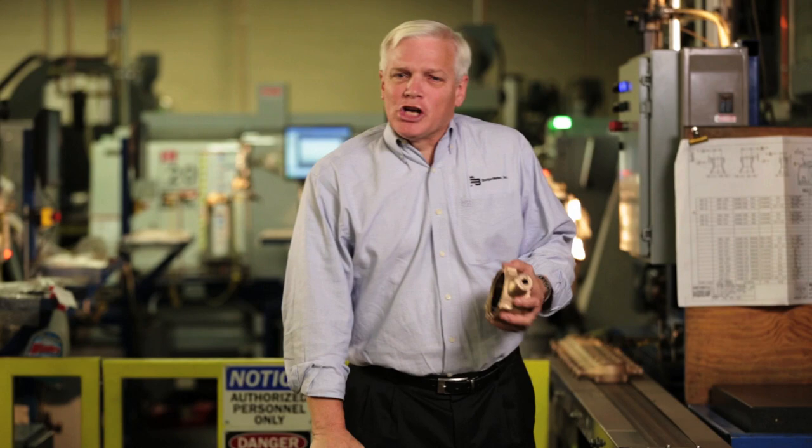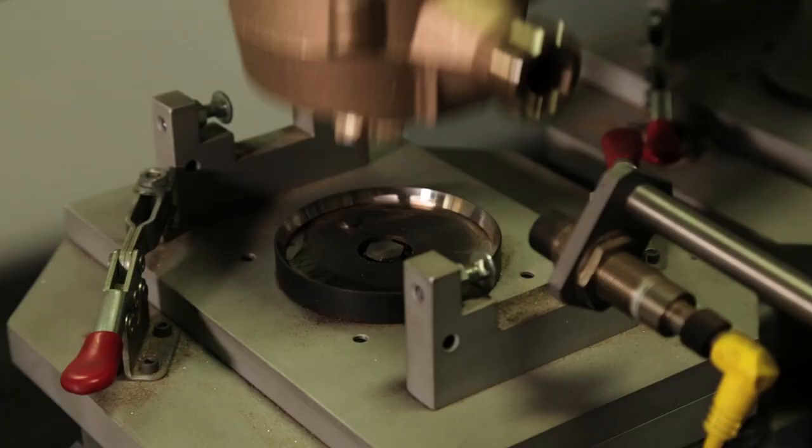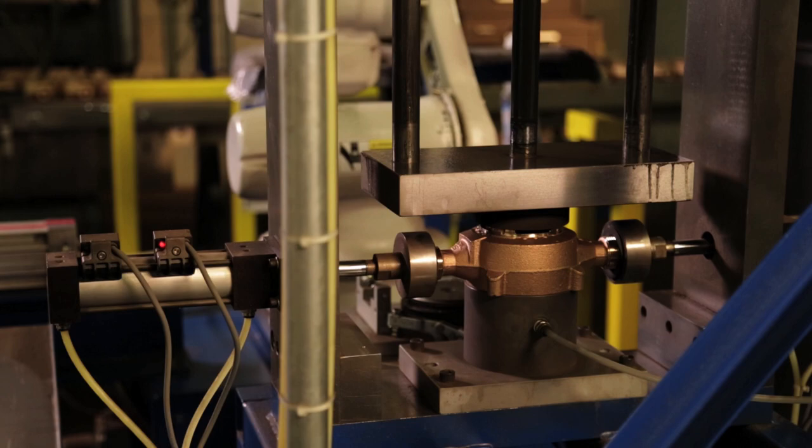After a little bit of cleanup, they're ready for the next step. Now we're on the south side of Milwaukee at Fall River Manufacturing, where in a highly automated process they'll take this rough casting and turn it into a finished machined casting ready to be made into a water meter. Each of these machines has a specific job, from machining the surface for the actual register to threading the ends. They drill and tap for the bottom bolts and even perform a leak test to ensure they are 100% defect-free.